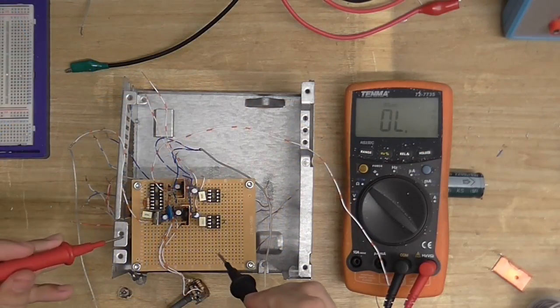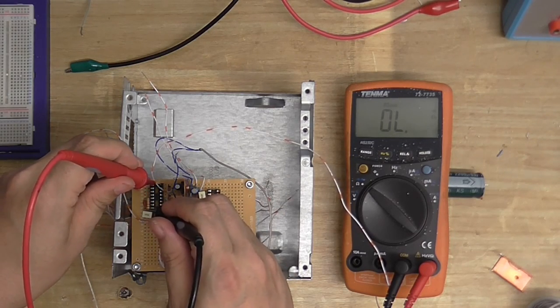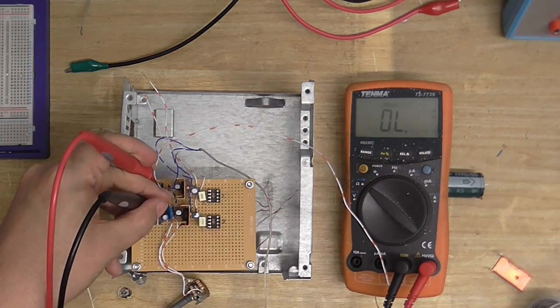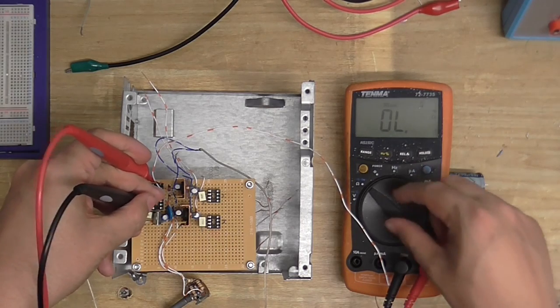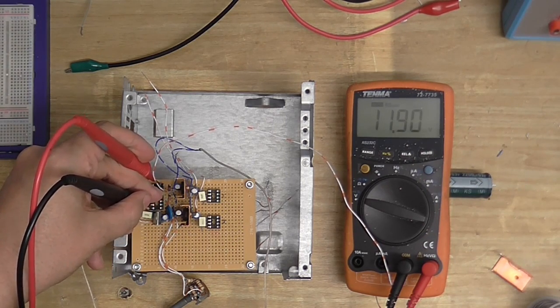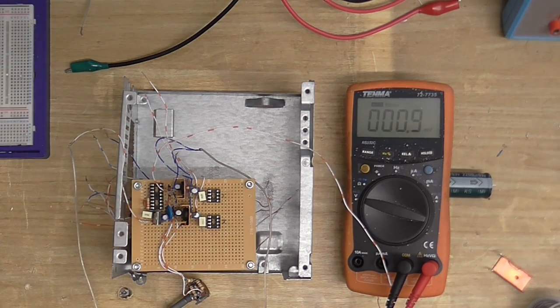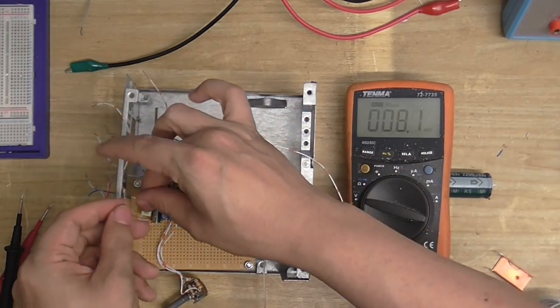Let's see if the voltage regulators are doing their job. So, gonna put my meter across the power rails, where the CD4046 is gonna go, and we should have about 12 volts there when I supply power. Of course, it would help a lot if I put the meter onto the right setting. Okay, we got 11.9 volts, well that's close enough. I'm putting about 23 volts into this thing, because that's as high as my power supply will go up to.